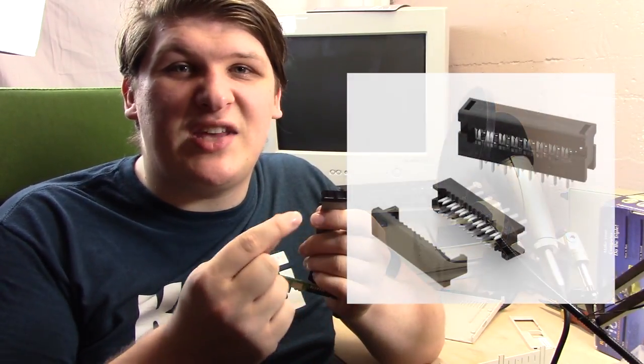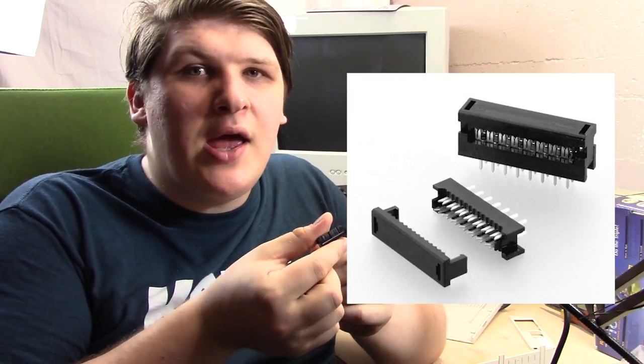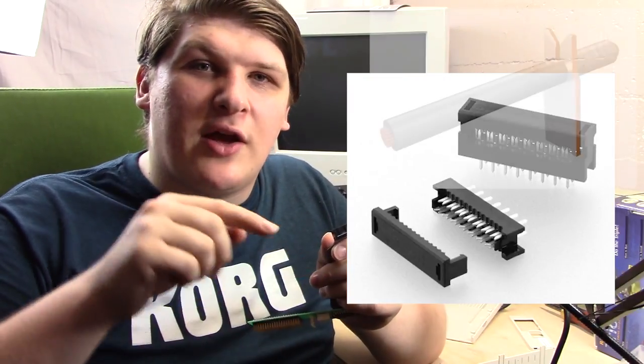The only difference between those connectors is how many columns they have on them. The reason ribbon cables are popular is because you can terminate a lot of wires at once. Terminate means you don't have to solder each and every one of these. There's 20 wires here. If you were to solder each one at 10 seconds a piece, that adds up to several minutes worth of soldering. You can do one of these in less than two seconds per end — you just slip, crimp, done. These connectors are called insulation displacement connectors, and the way they work is inside the connector there's a bunch of little metal teeth, and when you put the cable in there and squeeze the back down, it crushes the cable into all those teeth. They go through the plastic insulation and right into the wire. So you don't have to strip each individual wire, and they make these all the way up into 80-line and even more.